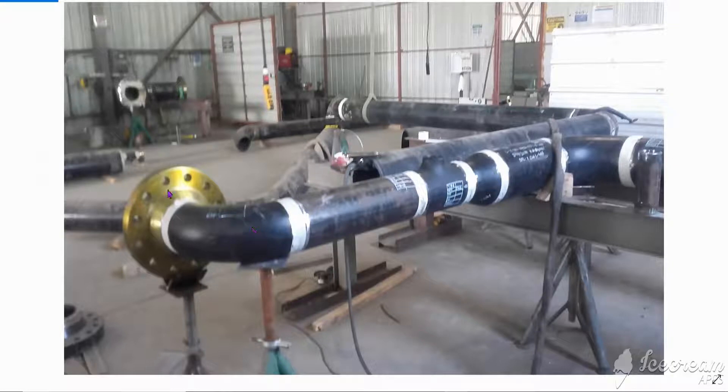This is a 90 degree elbow, this is a flange, this is a tee reducer. This picture helps us understand how to fit up. This is not rolling — this is the 90 degree elbow; there is no rolling. This is all welding joint. At every welding joint side we should write the WPS number, fit-up date, welder number, builder ID, and line number. We should write this — you can see here, it is already written — we write like this for the QC.